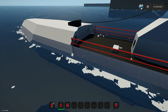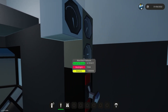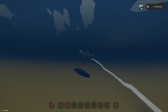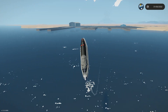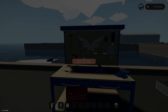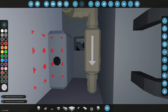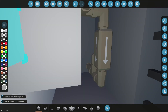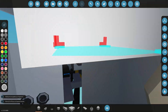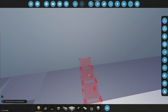If you guys decide to build your own submarine, just keep that in mind. The best way I found to get the exhaust out of the engine is using an impeller pump powered by the engine itself. Getting the exhaust out of the engine is going to be one of the biggest issues if you decide to build a diesel sub, so just keep that in mind with your own builds.